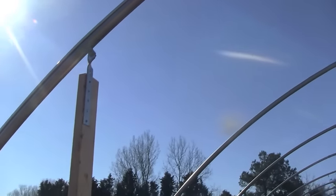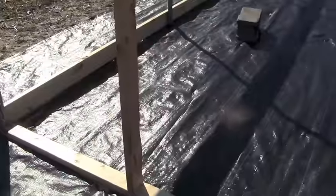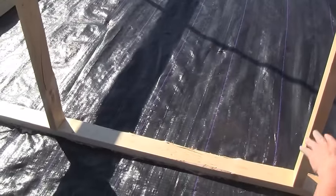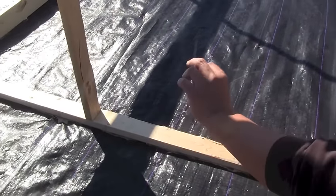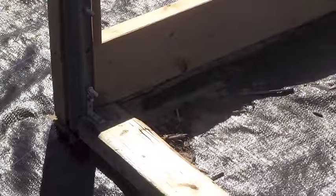You can see the end wall brackets at the very top — it's nice and secure and stable. Just to make sure it was as close to the ground as possible, we actually stomped on the bottom two-by-four to get it nice and snug. When you're cutting these out, be as close as you possibly can — maybe a fraction of an inch more — because the tighter it is in there the better. If you have a quarter-inch gap between the end post and the two-by-four, it's going to be loose and that's not a good thing.